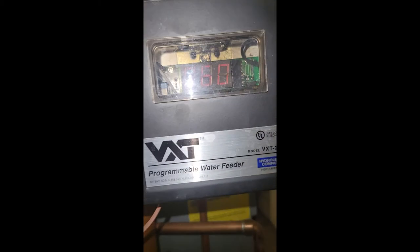I'm going to recommend a service, probably a pressure relief valve replacement, water treatment, some of the vents, and other things going on here. You can see 86 gallons have gone into this feeder — that's quite a bit of water. When I do maintenance I like to reset that counter so I can see the following year how much water it took. Normally 12 to 15 gallons per season is average. Anything higher — say you come back and see 30 — you're losing water somewhere: check a wet return or maybe a radiator has been leaking. I once had a case where the feeder kept going through a lot of water and it turned out to be a broken wet return in the slab. I'll clean up, let her know what's going on, give her some options, and we're good.